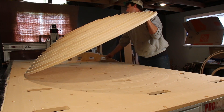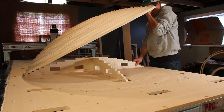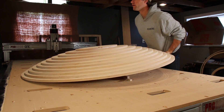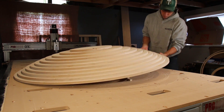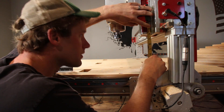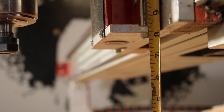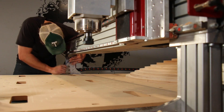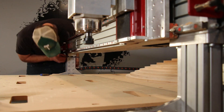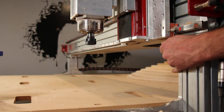The next day I pulled the wax paper out and started getting ready to carve the outside of the bowl. I realized that although the underside of the gantry clears eight inches, there are two bolt heads that hang down a quarter of an inch and the stacked plywood was going to be too tall. After thinking about it for a while, the easiest fix was to loosen the gantry and slide in a quarter-inch spacer, which worked pretty well. If only I knew someone at Avid CNC — I might suggest that those two bolts could be countersunk flush pretty easily.